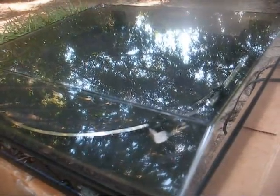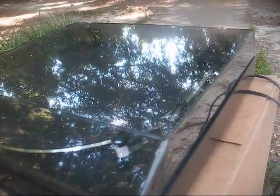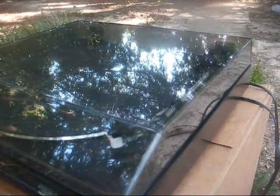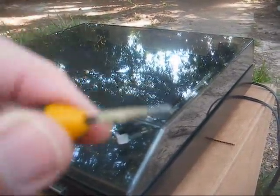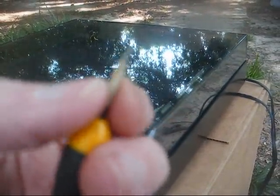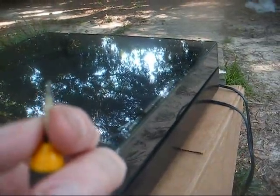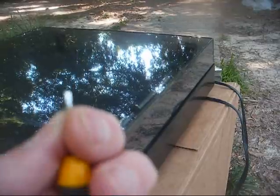Now that we know where the speed adjust trimmers are, you need to find a couple of suitable objects of equal height so you can sit the turntable up on them so you can easily get under the bottom of the turntable with your screwdriver to adjust the pots. And for a screwdriver, I have a small flat blade screwdriver with some masking tape wrapped around it so we won't accidentally short the screwdriver to the case of the motor. That won't hurt anything, but it'll cause the motor to run wide open, which will make adjusting the speed very difficult.